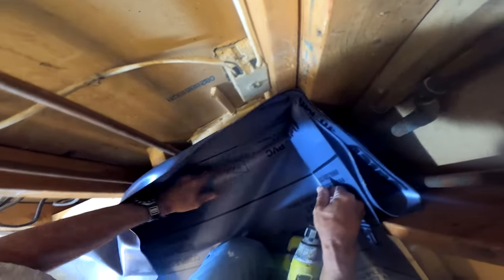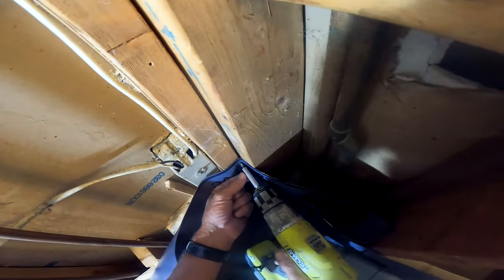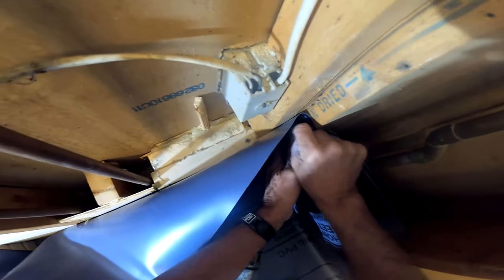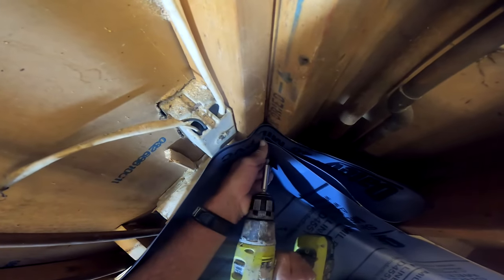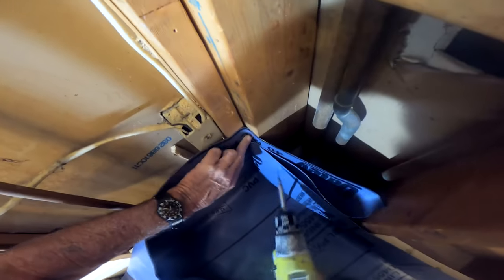On the shorter end of the pan I always do the longer-wall folds first, then do the fold at the curb. I'm putting my fasteners as high up as I can. In this case I have a pretty good height on the shower pan liner, but I'm sometimes relegated to go down to about a six or six-and-a-half inch mark where I've installed some scabbing of two-by-six between the studs. I'm drilling right at the top of that two-by-six and getting it tight into the corner.